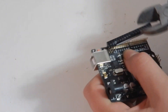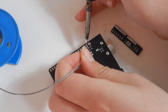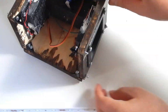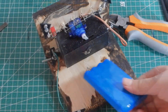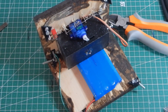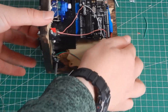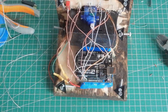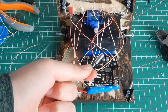First I'm going to remove all the pins from the Arduino so that I can solder all the wires directly to the port. First the Arduino powering circuit — negative gets connected directly to the Arduino, battery, and the DC jack. And positive gets connected the same, but with the switch in between the battery and Arduino. Now if I flip the switch, the LEDs on the Arduino should light up. If they don't, check the circuit and make sure the battery is charged. Then connect the servo, button, and LEDs from the shelf side to the Arduino, and of course also the two tilt switches.